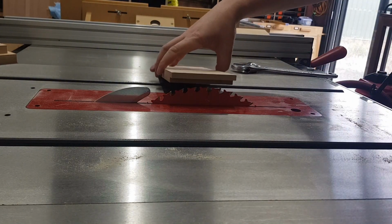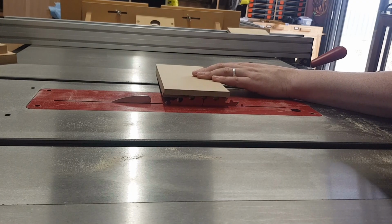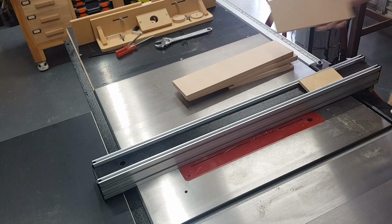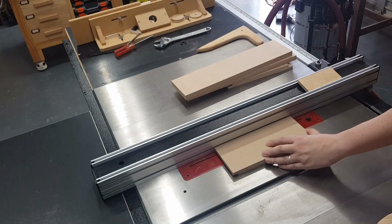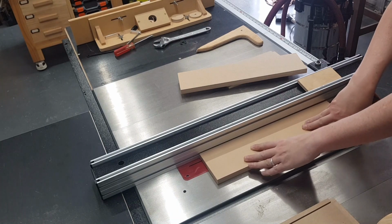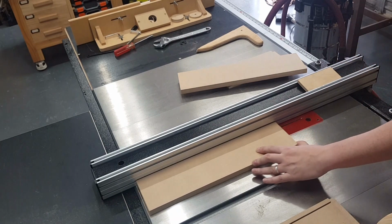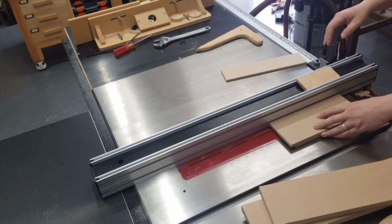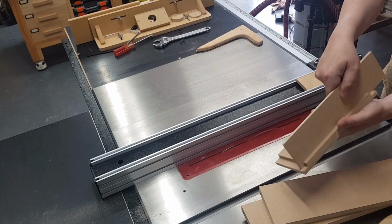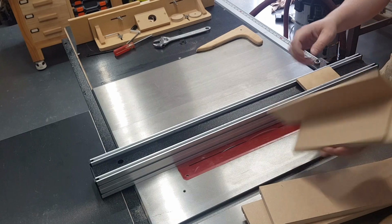The third and final cut for our drawer frame is to make the groove that accepts our bottom panel. Our panel bottom is 6mm thick, so we need to create at least a 6mm groove in all four sides, and to achieve this I'll use yet another technique on the table saw. With each pass over the table saw, we simply bump the fence over a fraction and work our way up to getting the right friction fit.